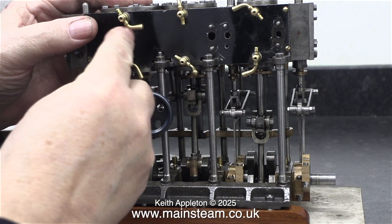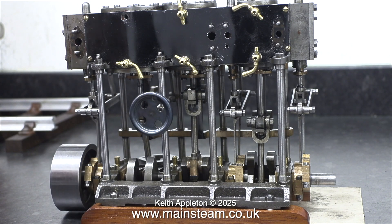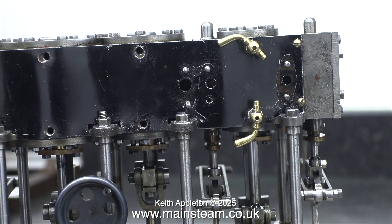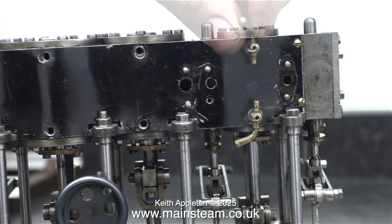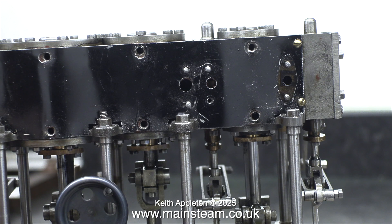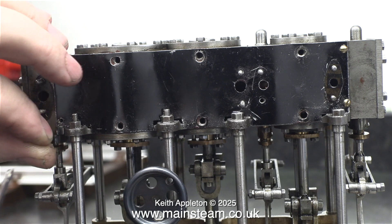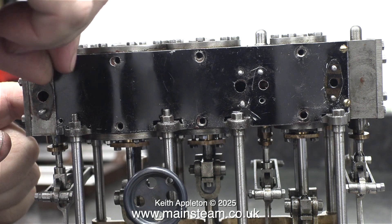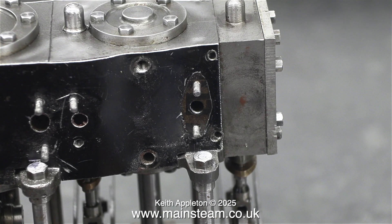The first thing to do is remove all of the brass drain taps. These need fitting in place either using shim washers or some sort of sealant that holds the drain taps in the correct position. I got some stuff from a company called Clevedon Steam called SAS Nut Lock. It's really good for holding fittings rigidly in one position, but unlike Loctite 603 or 638, which are high strength retaining compounds, using SAS Nut Lock means you can actually break the seal and start again if you get it wrong.